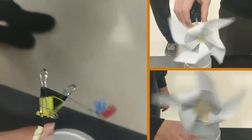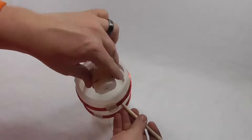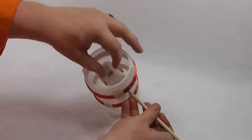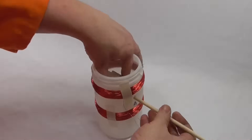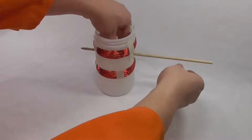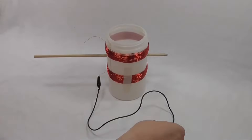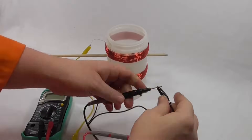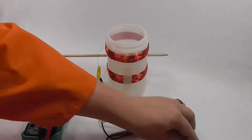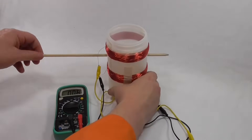But now your model will spin a magnet instead of a string. A changing magnetic field can induce an electrical current, especially if the electrons are given a path through which to pass their charge. By wrapping magnetic coated wire, you'll have the opportunity to build your own copper coils. The spinning magnetic force created by the spinning magnets will push the negatively charged electrons through these copper coils. If you can move electrons, you can generate electricity.